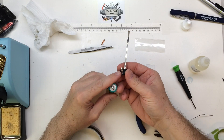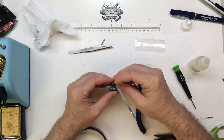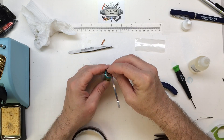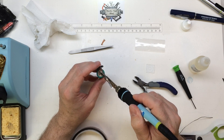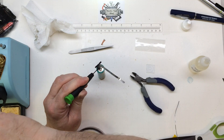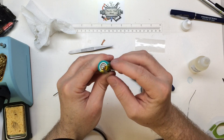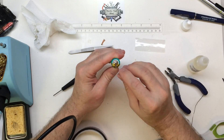I've already prepped the battery with some solder on the negative side. I want the positive going in this direction, so I'll trim just a little bit off — I don't need it quite that long. I'll put it right here. There goes our negative connection. This is where the Kapton tape comes in handy, protecting us really well here. We'll trim the positive lead to the proper length and we're ready to solder it on.